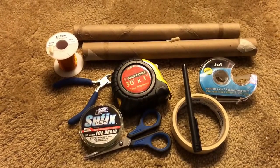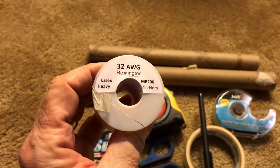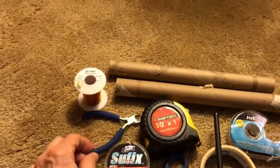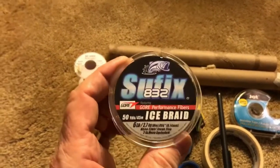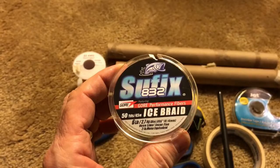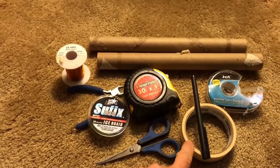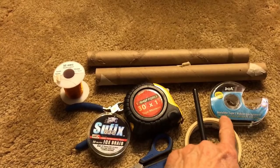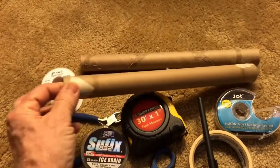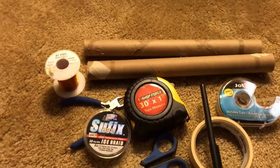These are the items you need to make the antenna. Of course you need the wire — I use 32 gauge wire, though other people use 34 or 36 gauge, which saves some weight but is a little easier to break. You need wire cutters and the support string. I use a Gore-Tex string, which is good down to very low temperatures — and we reach very low temperatures at night at the altitudes we go to. You need scissors, masking tape and a pen, scotch tape, something to measure 17 feet, and two cardboard tubes from paper towels, wrapping paper, or aluminum foil rolls.